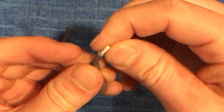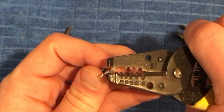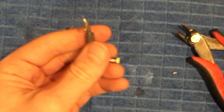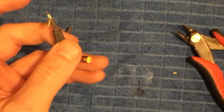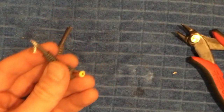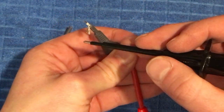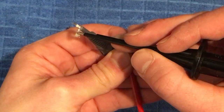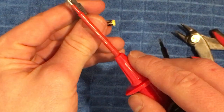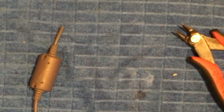There are two layers here: the shielding on the outside, which is basically stranded wire, and then some insulation, and underneath that is more stranded wire. We need to make absolutely sure which is which — normally the middle correlates to the tip and the outside correlates to the sleeve, but you always want to double check. So to do so, just use my multimeter: touch the outside sleeve, touch this shielding, and that beep means continuity — so negative to negative.